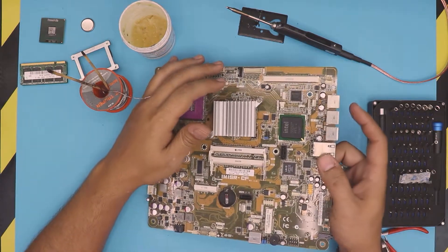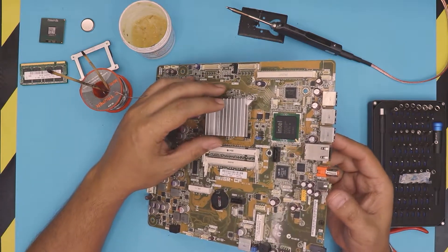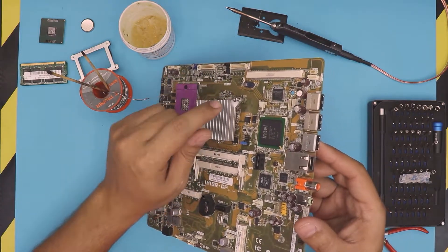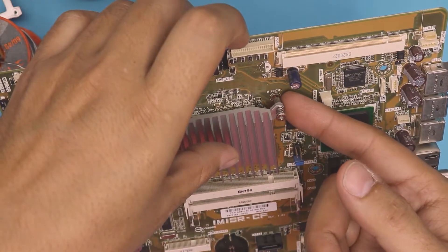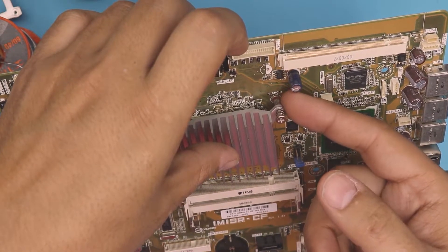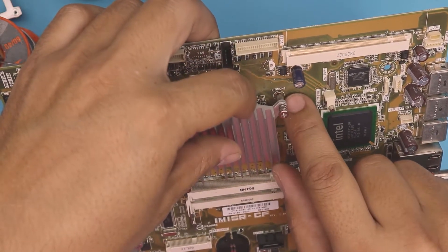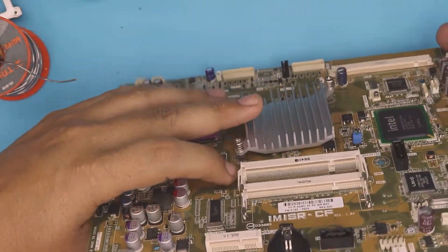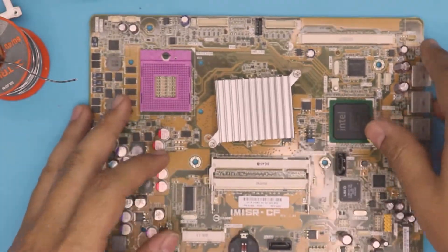This one is an all-in-one PC and the riser is broken, as you can see. The heat sink is right here and the riser down there is broken. The whole thing came up — they don't actually destroy the pad, the pad stays there, it's just that the pressure breaks the soldering. On this one, both sides are broken.